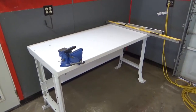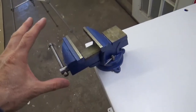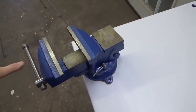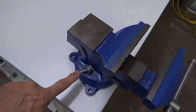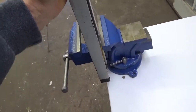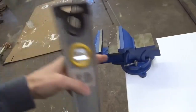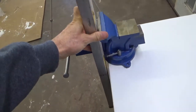Welcome back YouTube. It's time to put the vise on the workbench. I've got a five-inch vise and I want to position it in the correct spot. There are two jaws — one is movable and moves in and out by turning the handle. The whole vise will rotate by loosening the two screws. I want this surface of the jaw to be out at least to the edge of the table, so that when you have long items and put them in the vise, they can drop down below the face of the table.